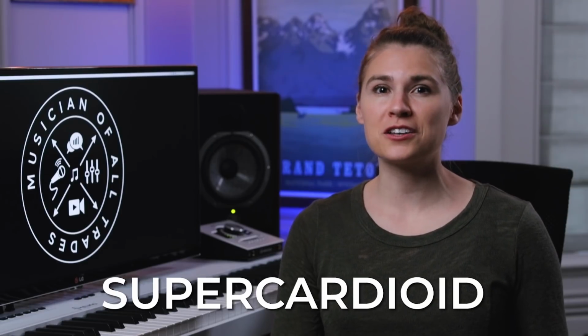Alright, now that we've gone through the 3 types of microphones I'd recommend, I'm back to talking to you guys through my Sennheiser microphone, and now I want to go through some of the different polar patterns available on these mics. In case you're unfamiliar with that term, a polar pattern describes a microphone's directionality. It's kind of confusing to try and explain, so I'll link you guys to some pictures that will hopefully give you guys a better understanding of what I'm referring to. Every microphone has a polar pattern, and some of the more common ones are cardioid, figure 8, omnidirectional, supercardioid, and hypercardioid.